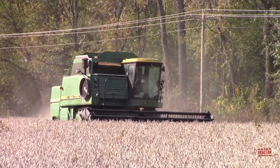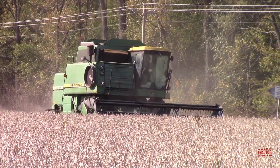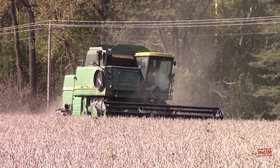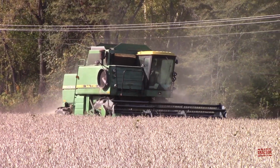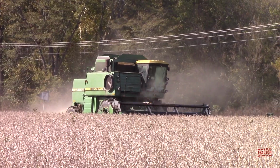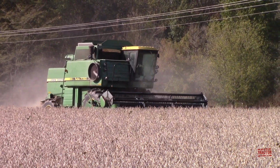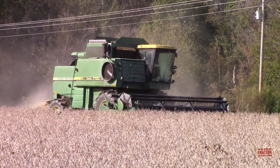A standard 7720 Turbo rolling out of the East Moline combine factory would be equipped with a John Deere 466 cubic inch engine rated at 145 horsepower and would feature a positorque ground drive. There was an optional upgrade to a 165 horsepower rated engine with a hydrostatic drive for an additional $3,672. This combine is harvesting 20 feet of soybeans per pass with the John Deere 920 grain head